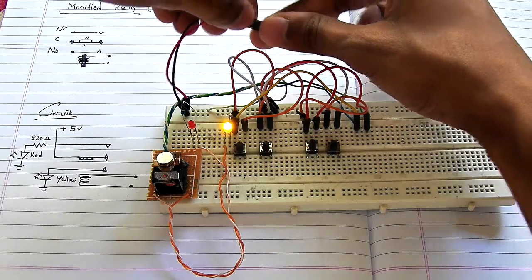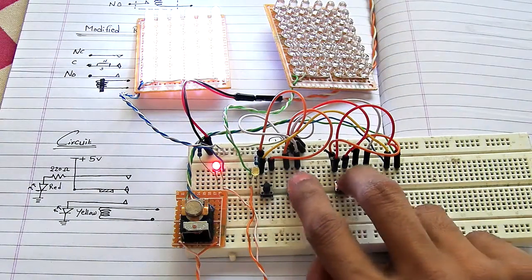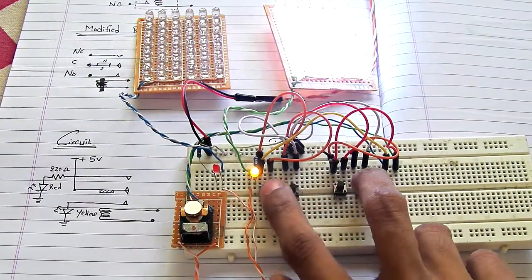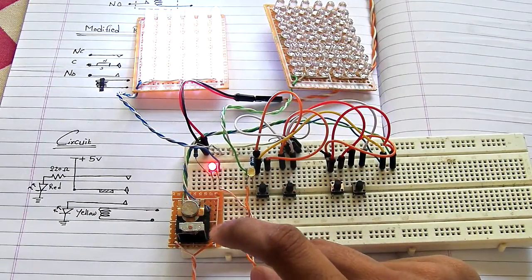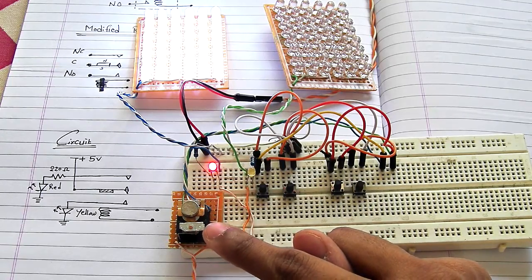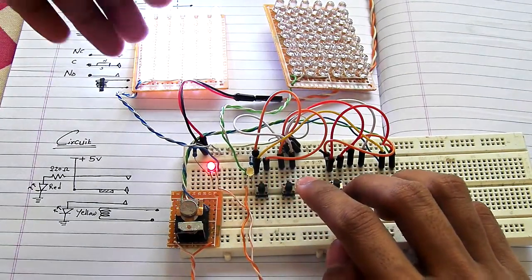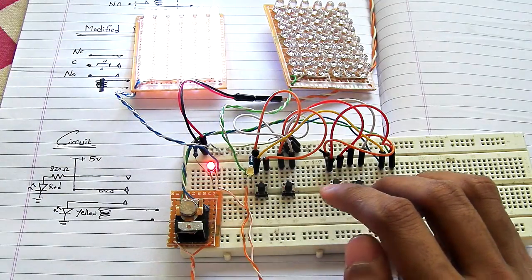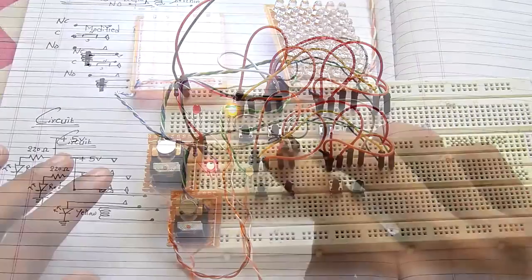Right now I connected a 50 LED strip and as you can see it can handle power very well. The limitation is only the amp-handling capacity of this relay. If it were an IC, it surely cannot handle that much power directly with the sinking supply of the IC.